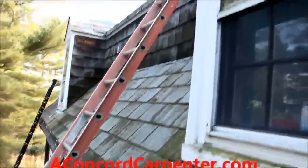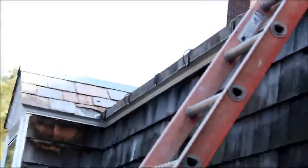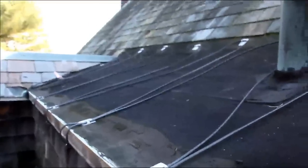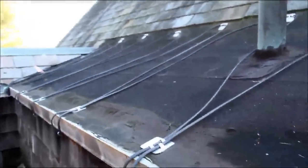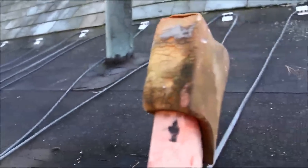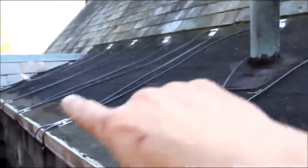The cable runs all the way down the gutter, and up above on this dormer you can see the tapes draping over the side. We use eye hooks to get the tape over the edge and hanging into the gutter. This surface on top of the dormer is actually an asphalt roll roof — it should really be done in rubber. For now, we'll make it through this winter with the heat tapes and probably end up putting rubber up here and reapplying them. The zigzag pattern runs about four and a half to five feet up the slope, past the vent pipe — we originally planned three feet but decided to do the whole slope.